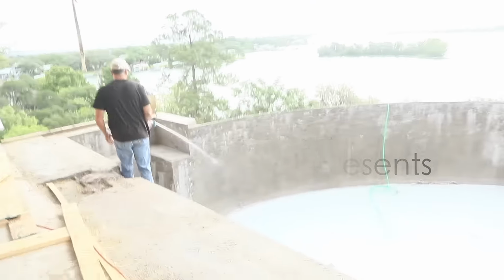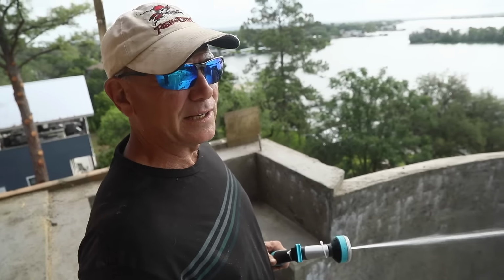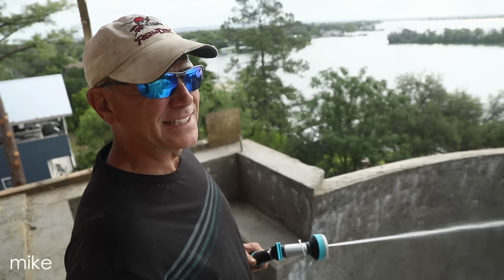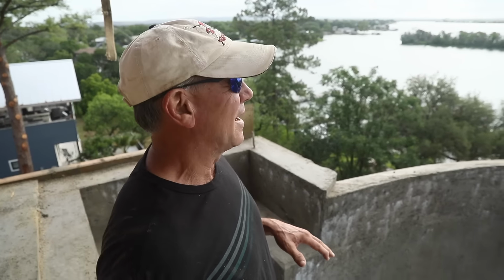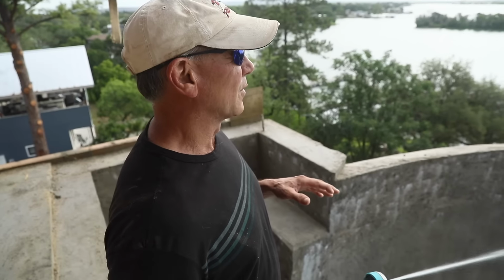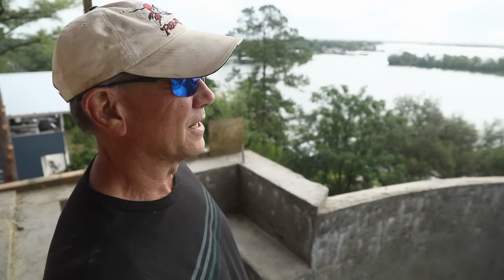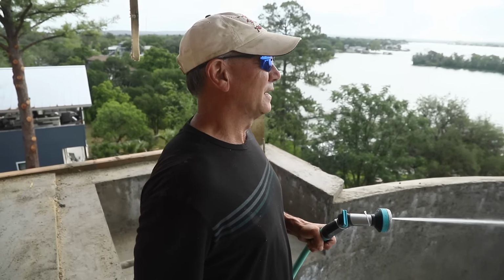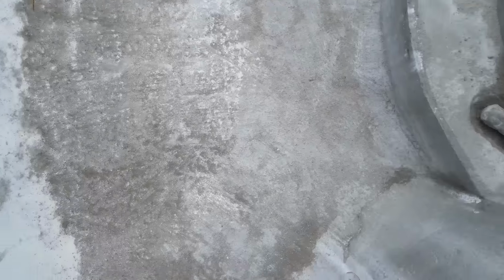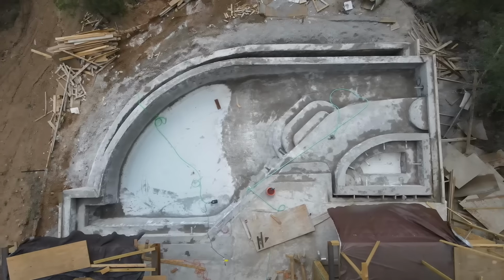For a week. And more moisture put in it during that week helped strengthen it another 50, 60, 70%. Unlike cement, you don't water it, you let it dry out, because it's got a lot more water in it when you pour. This has a very insignificant amount of water, so that it'll stick. So then you have to really water it down afterwards to get it to activate and harden up. So we've been watering it all weekend with sprinklers and hand watering it. We did it Thursday, Friday, Saturday, Sunday, Monday, Tuesday. So we're a couple more days and we'll be done.